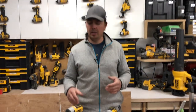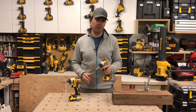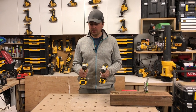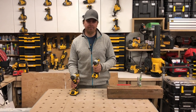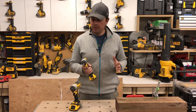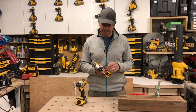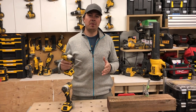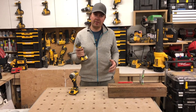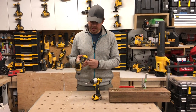If you're driving a lot of screws, if you're framing or whatever, I highly recommend the 20 volt — don't even joke around with the 12 volt. The 12 volt is not designed for framing. Yes it is smaller and lighter, but don't use it for framing. It's more for cabinetry, great for keeping in your tool bag for some quick screws. It's nice and light for electricians jamming boxes in — it's pretty sweet.